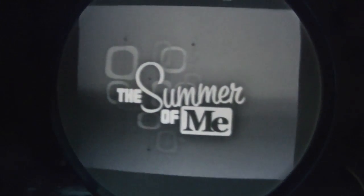This is a really good picture too, and I'm hoping it will get even better when I do an alignment, because this set has a pretty good IF with stagger tune, staggered amplifier sections, or staggered coils rather. It has a nice wide response.